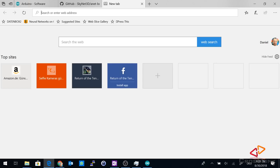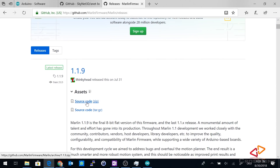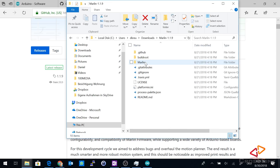Step three is to download the Marlin firmware from GitHub. By the way, I'm putting all the links you need — links to the Arduino IDE, the Anet board definitions, and the Marlin firmware source code and configuration sample — in the description below this video, so check it out. We go to github.com/MarlinFirmware/Marlin/releases, where we get a list of current versions. The most current version is on top, and we can directly download the source code zip file. Open the folder, unzip it — here it is, Marlin 1.1.9, the current version — and this can be opened with the Arduino IDE.